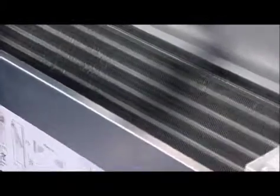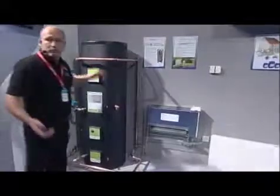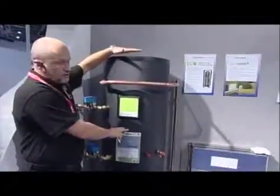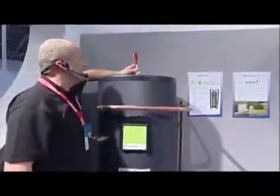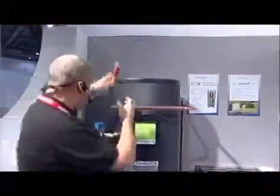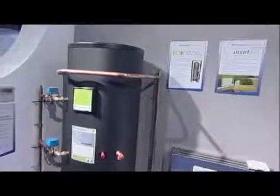With regards to commissioning any heat pump system, some of the key things to remember are the removal of air from the system. Built into the radiator at the top there's a small air vent — we must ensure we remove all air out of the system in a radiator circuit. On top of this cylinder there's a buffer tank built into the domestic hot water cylinder, and you can see there's an air vent so we can get all the air out of the system to prevent faults from occurring. We've also got an air vent at the highest point within the whole system. Removal of air is absolutely crucial to commissioning the system.